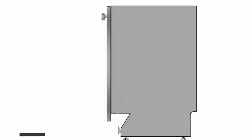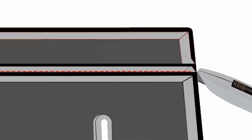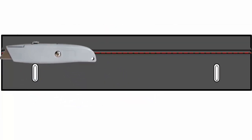Place the toe kick on a protective mat where it can be safely trimmed where marked. Flip the toe kick upside down and choose one of the two pre-perforated cutting lines that best align with your pencil line on the opposite side. Using a utility knife, carefully cut the right and left perforated areas, and then score straight across and separate.